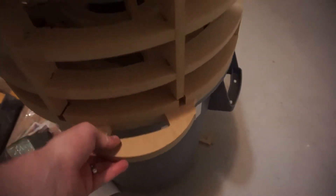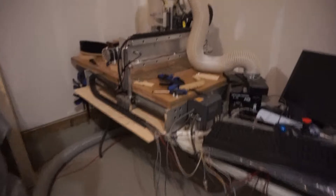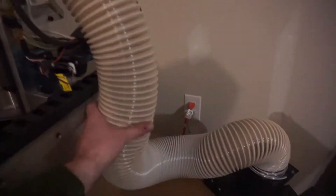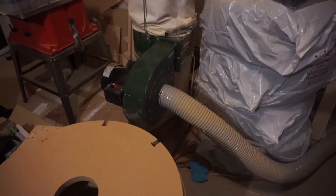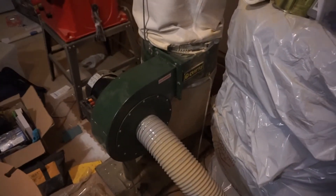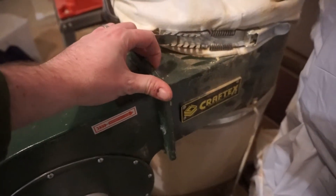This isn't exactly lightweight, so it should seal up well enough that we shouldn't get too much air leakage. Then that'll sit between the CNC router, which has got its hoses going down underneath the very crappy folding table that's kind of bending a bit under the load. It'll probably go down under where that joint is or out here somewhere. And that will be my cyclonic separator to fix up the issues with the very cheap Busy Bee dust cyclone, which is pretty good but I've had to reseal all of this interface.